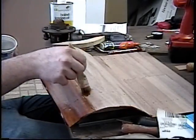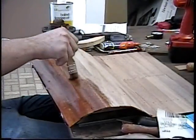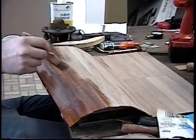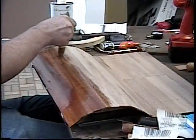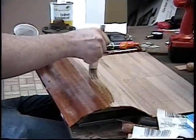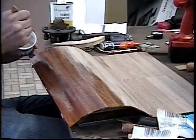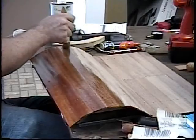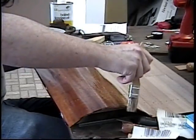Yes, the ridiculously helpful Mr. Harold managed to dig up in his archives a description of how lagging would have been finished and treated. And as per those instructions, the wood is sanded with 160 grit sandpaper. Actually, I used 150 because that was the closest I could find. And then it is brushed with linseed oil. Few coats of that, and then a nice shellac put on over that, which is, as you may or may not know, made from beetle shells. Pretty cool. Then I haven't picked out the varnish that's going to go over that yet, but I'm going to try to find something period correct, wax based or some such.